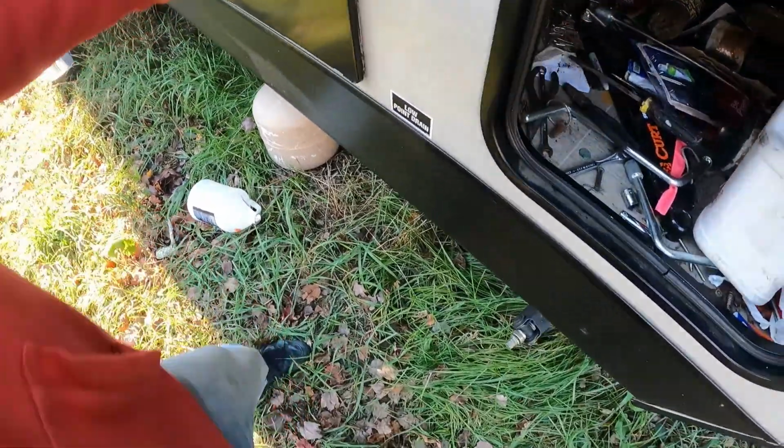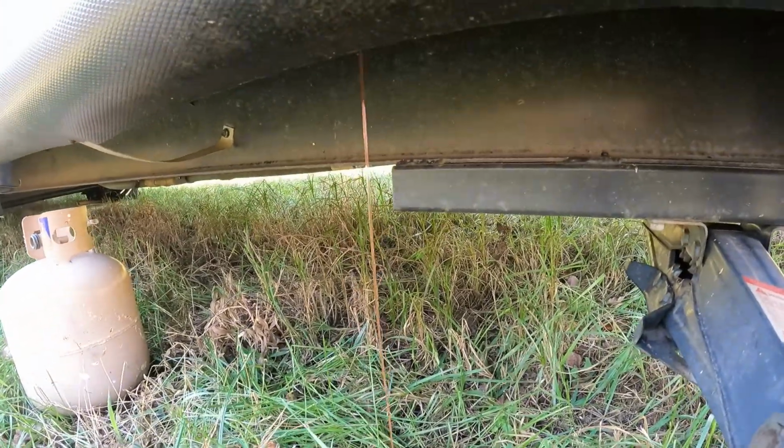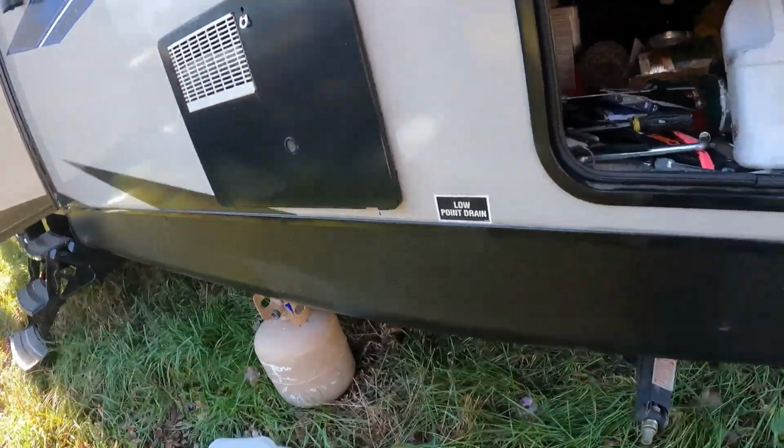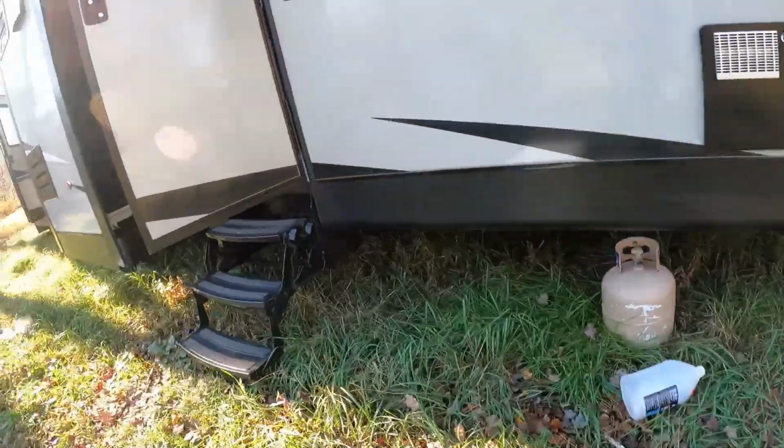Same time, come out here, close that. Close up your water heater. Now, another thing that sometimes I like to do is to pull these drains again, and there you go. You can see some of the antifreeze coming out. Lines are drained. It's that much less pressure of any kind in there. It doesn't need to be in the lines.